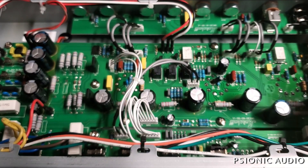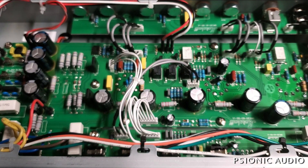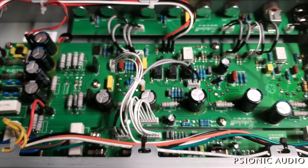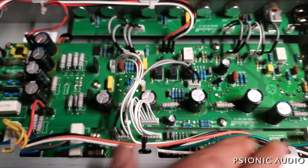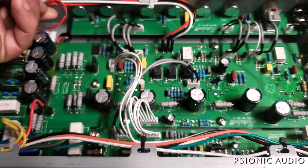Some techs would have just put in a 5-watt resistor there — here's a 150-ohm, 6.3-watt actually — and maybe it would hold up. But I think there is way too much current present outside the parameters of the intended design, and that is what is causing that resistor to fail. I had hoped it was the known problem with the output jacks in this amp, and I corrected that — you can see that in the first video — but obviously there's something else.